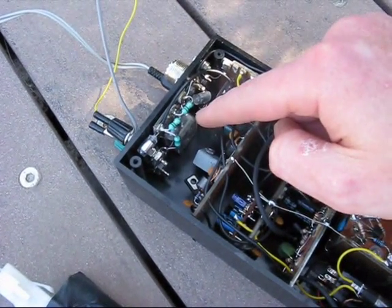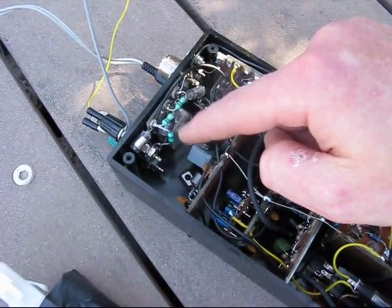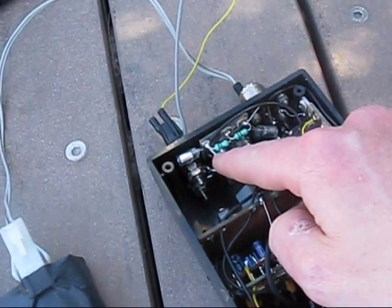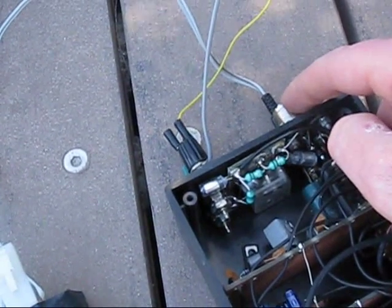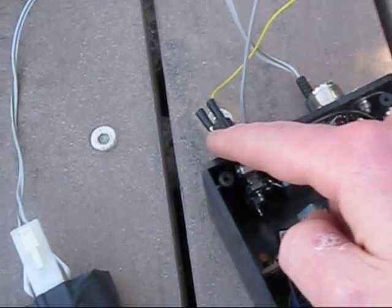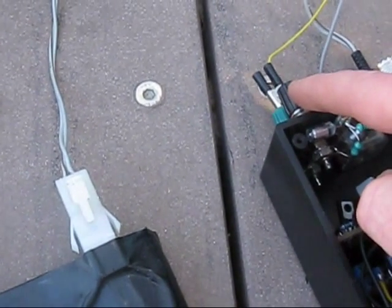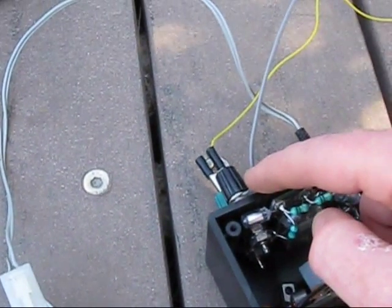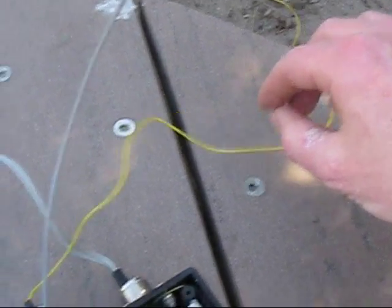The Pi network is the low-pass filter, and that's in circuit in both transmit and receive. An addition is the L-match antenna coupler, built into the transceiver to save space. The transceiver actually has two antenna sockets: an SO239 for low-impedance 50 ohm antennas, and two binding posts for an end-fed wire antenna, which is high impedance if it's the usual half-wave long. With that type of antenna, you don't need much of a radial or counterpoise for the antenna to be reasonably efficient.